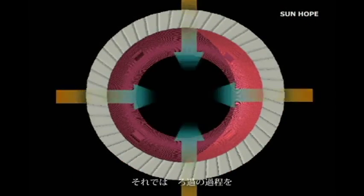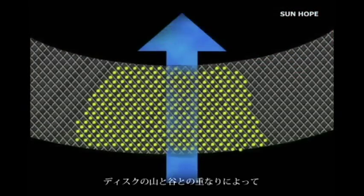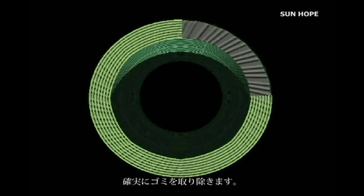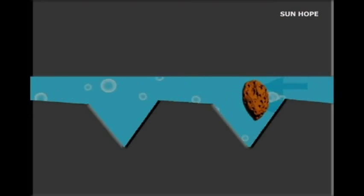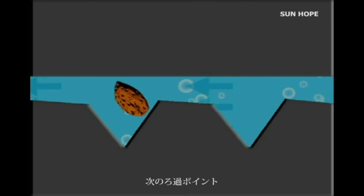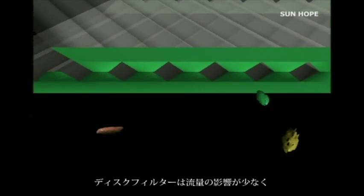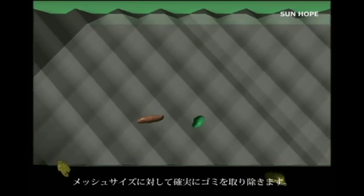Let's take a closer look at the in-depth filtration process. The junctions between grooves and shoulders form a matrix of consecutive stopping points, which let the water through and stop contaminants, rather than just one stage in a screen-based filter. Even if a solid passes one stopping point on its narrow dimension, it is likely to be stopped at the next one on another dimension. The filtration is accurate to the required grade, stable with no velocity effects and no breakthrough.